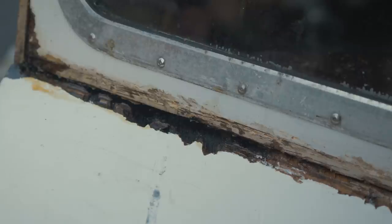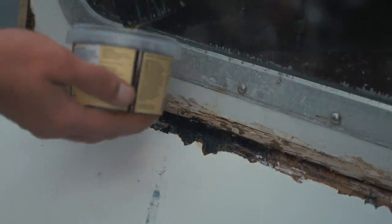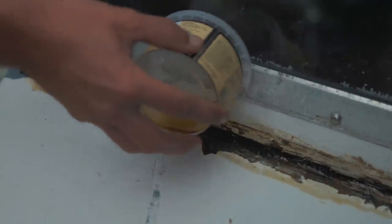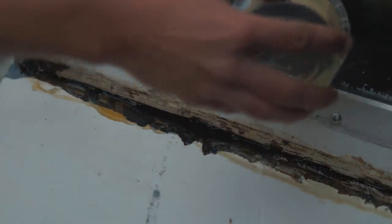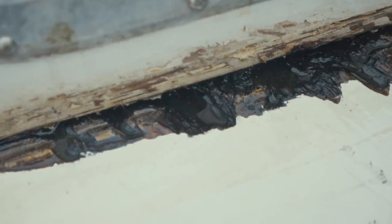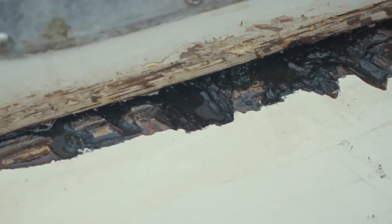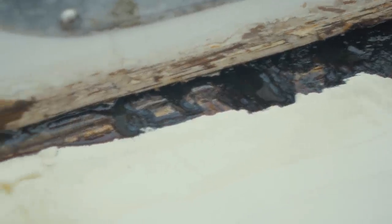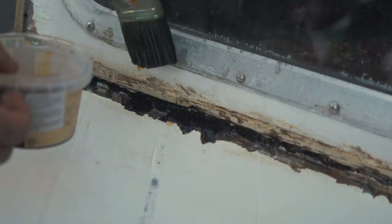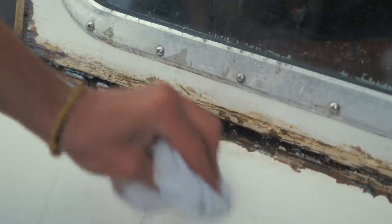I wouldn't have to worry about even doing the full length of the planks, seeing as this is going to be covered in canvas. I could just do a butt join on a truss or on a brace below. You know, I want to move on to bigger and more important jobs. So for now, I'm going to stabilize the planking, the rot. I will stop the leak, of course, and stop it from getting any worse. So I'm going to stabilize the timber.